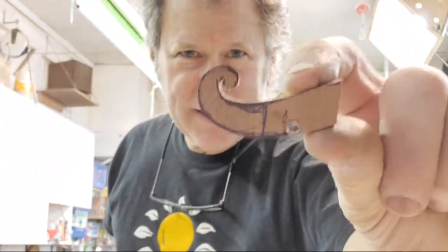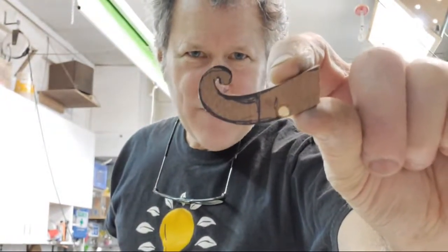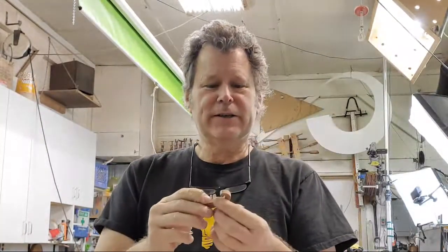I'm working on some other inlays. I made this little bending jig here. I'll be taking copper flat wire, wrapping it to make little spirals, and doing another inlay like that last one, but instead of the dark black purfling I'm going to be doing copper. Taking copper flat wire, putting it on edge into little spirals, casting black or blue epoxy resin around it, then putting it back on the lathe and turning it. A cool way of doing some inlays — that'll be fun, and it's a follow-up for the inlay class I taught last week.